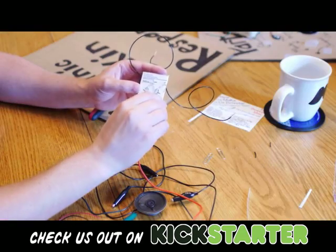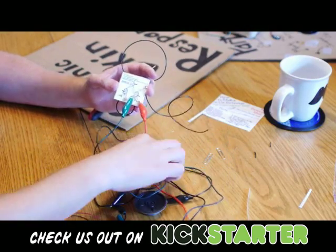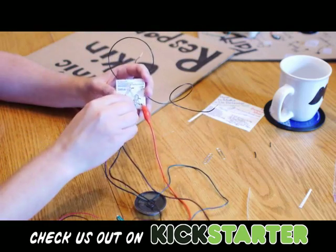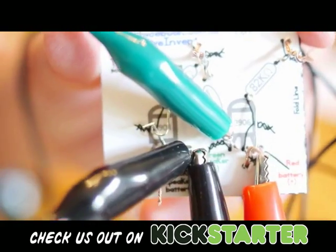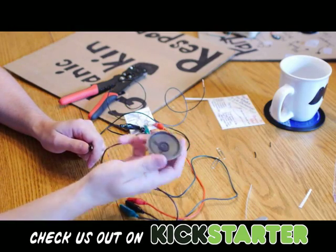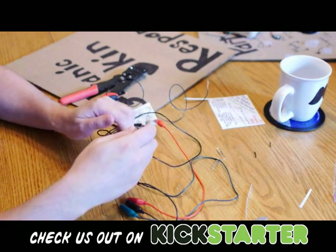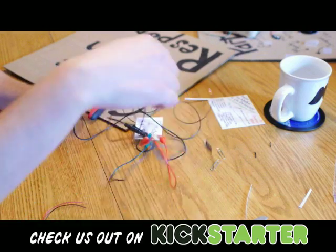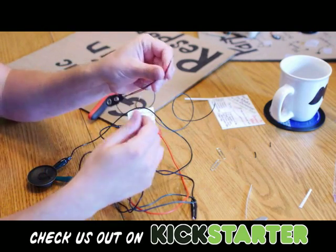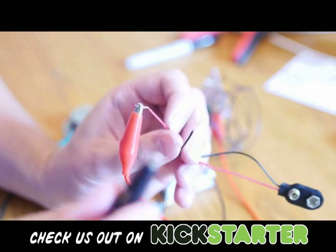Take your red one and attach it to where it says red — pretty simple. Take your green one and attach it to where it says green. Black — there's going to be two that go on the black. One of your black wires goes to the negative terminal on your speaker. Here's my little 8 ohm speaker. The negative or minus sign — I just clip that right to that silver part of the speaker sticking out there. The other wire is my green one and that goes onto the positive. Then my other two are going to go to my 9 volt battery clip, and I'm just going to hook my red wires together and then my remaining black wire.